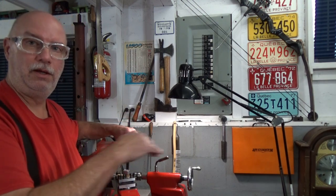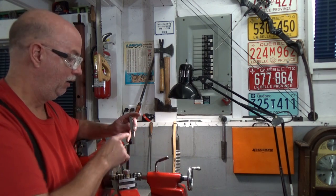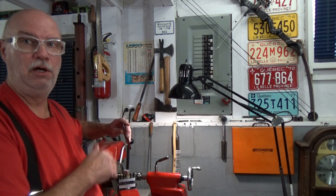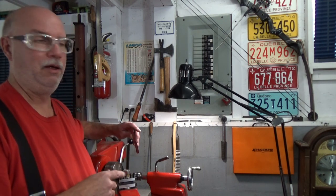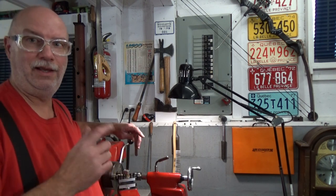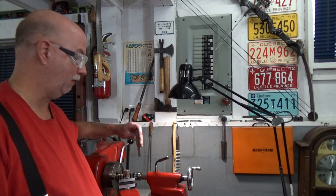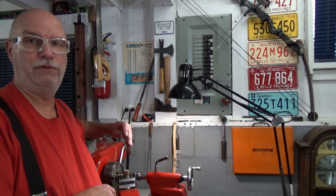So we're going to be checking by moving the longitudinal axis frequently to make sure that where we're touching off 10/1000ths from the surface, we're actually on the high spot. And we're also going to be doing it by feeding the tool towards the part, keeping the backlash on this side, and that's important because we don't want to be backing up, going forward, and all that stuff. That will position us 10/1000ths of an inch from the surface of the part.